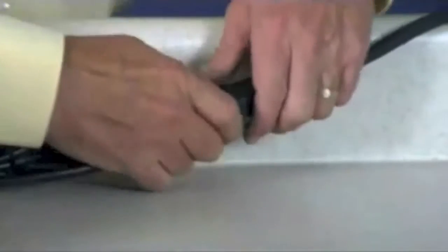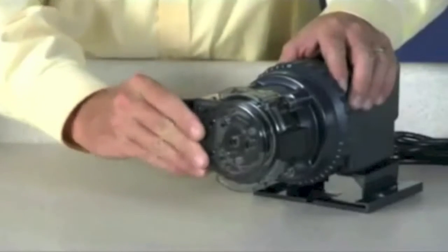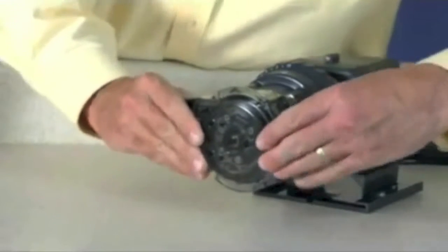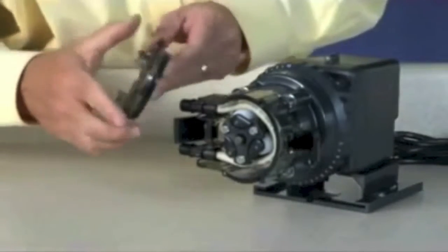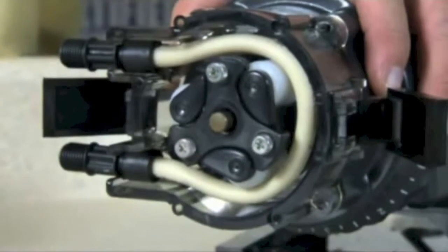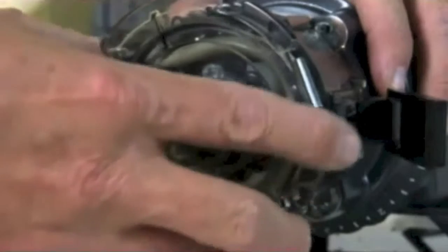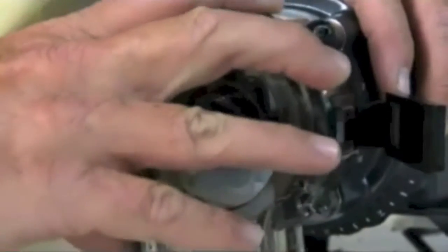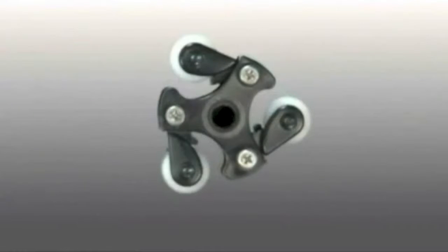Turn the pump off and unplug the power cord. Remove the tube housing cover and flip to use as a tool to expand the roller assembly. Align the center of the inverted cover with the center of the roller assembly so that the three holes on the face of the cover align with the three knurled plugs on the roller assembly. Position the cover feet near the bottom. The roller assembly needs to be expanded so the tube is pressed against the tube housing wall.